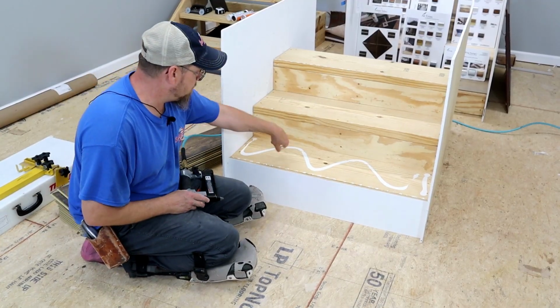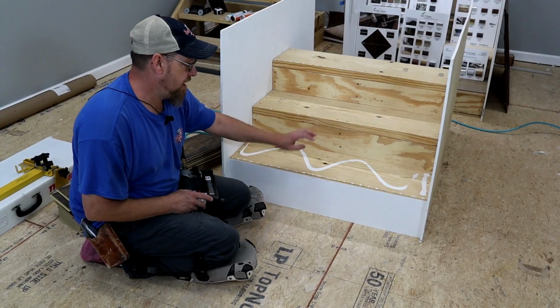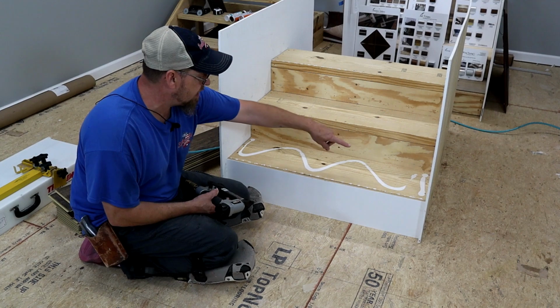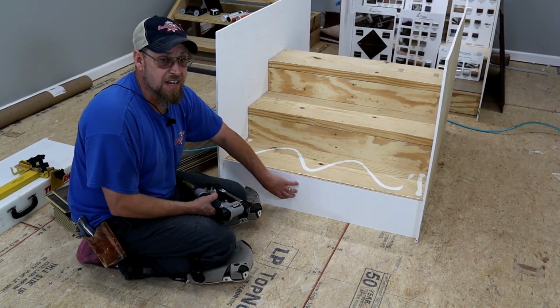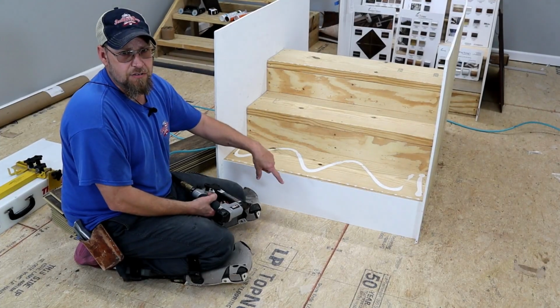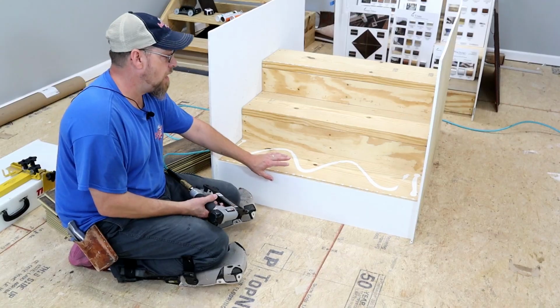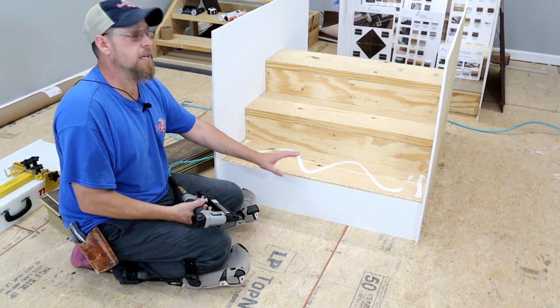You can see my glue pattern right here. You want to do that on your risers, okay? And I'll explain on the tread whenever we get there. So do your little squiggly line of construction adhesive like that on your tread, on your riser, and I'll leave a link in the description on some recommended adhesives that work really good for this process, okay? Again, I'm just going to pin shoot these on here just for the sake of the video, okay?